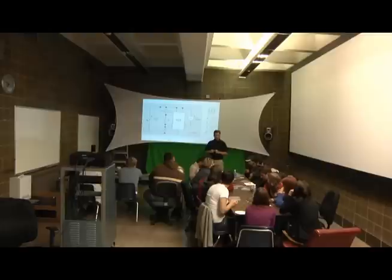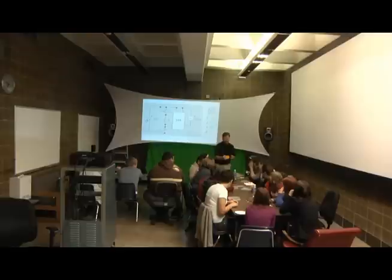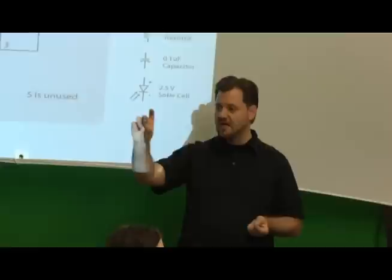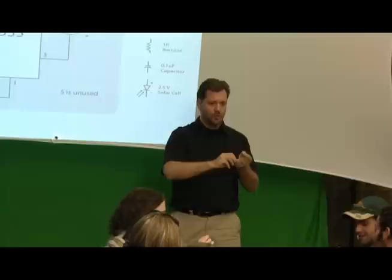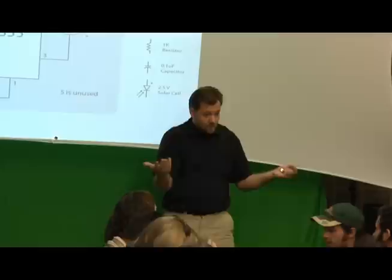So a resistor is going to be this little zigzag, okay? And we're actually going to use two types of resistors. You have a little yellow box. These are also resistors here. And I've also got a bag somewhere, I don't know where I put it, of another type of resistor. Most of you have probably used these every day. These are called pots, potentiometers. Every time you turn a dial, like the volume on your stereo system at home, it's a potentiometer inside that's changing the resistance of the voltage going through, which raises or lowers the volume of your system, okay? So that's what this does.